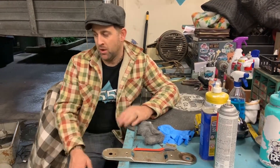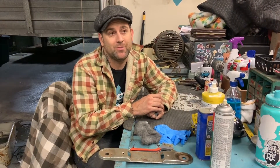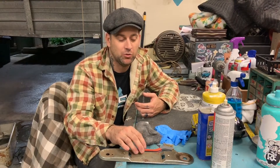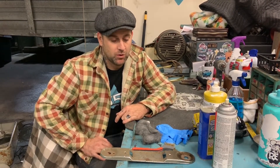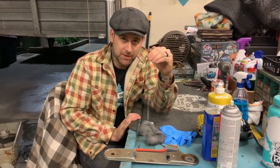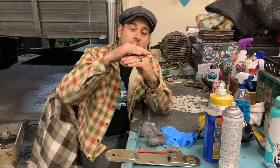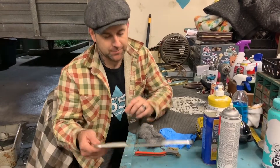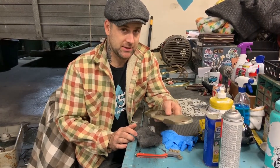I'm going to show you how to do it by hand, not with power tools. There are plenty of things you can't polish — if it's obviously rusted painted metal you're going to mess up the paint. I'm talking about chrome, stainless, aluminum — aluminum is really soft so you might scratch it. How to polish chrome: when you get holes in it, that's called pitting, and that's when the rust goes all the way through the plating — you can't bring that back once it's gone. But surface rust on top of the chrome you can polish, and it makes a big difference. This piece is a control cover for a box fan and I'm going to show you how easy it is to get this stuff off.